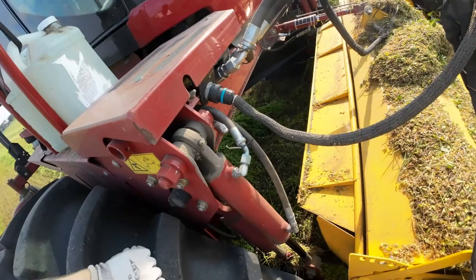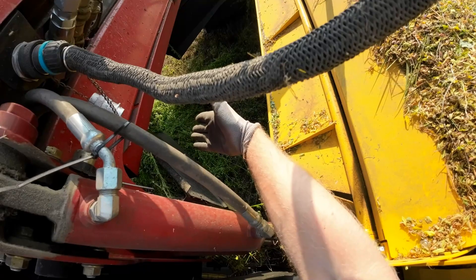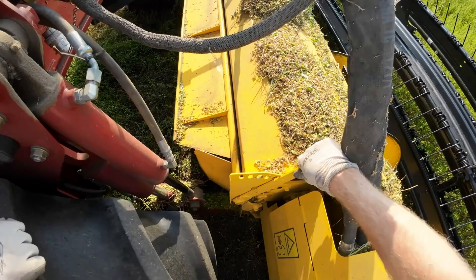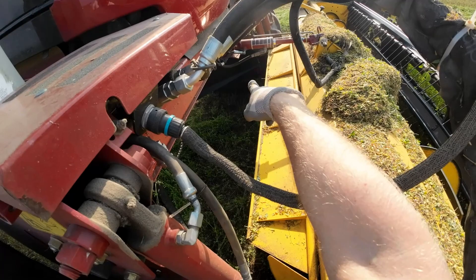Thicker crop this year so I've got to adjust. Now it's actually not really hitting the baffle at all because when I had it down at this setting, a lot of it would still hit the baffles yet, but some of it would just kind of drop off right away. Get them up here and then it completely misses that. Yeah, that's not even the highest setting — it's got one more notch yet, but when I lift up it hits that hose.